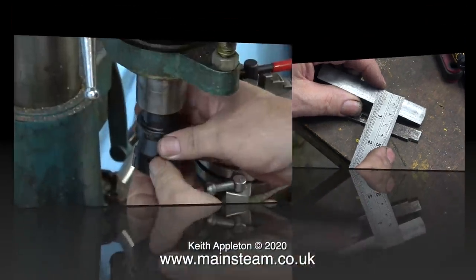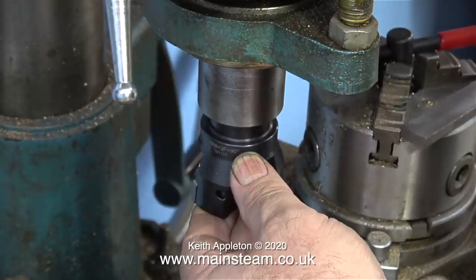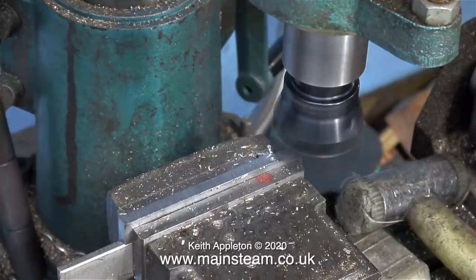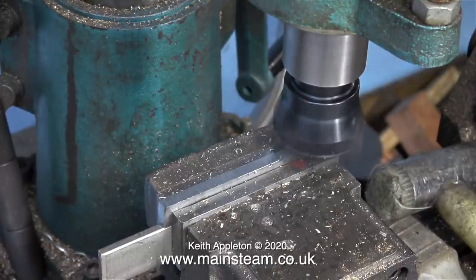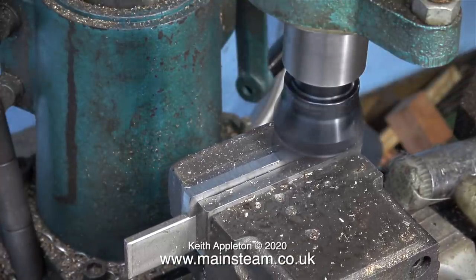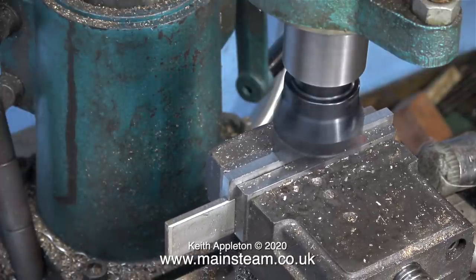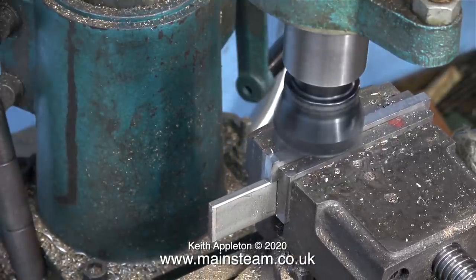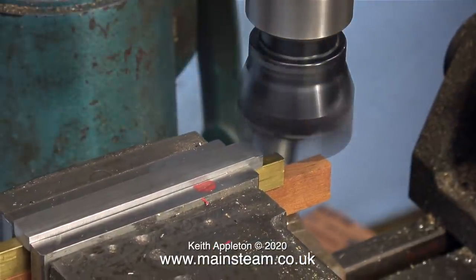But I have the technology, thanks to a man called Dan, who sent me this really good face cutter. Here I'm fitting the cutter into the R8 taper of the milling machine. With the bar resting on a suitable piece of packing, it's a very simple job to reduce the width. The milling machine I have is not very good quality — it's very old, made in Korea, and it's called a Nairok, which is 'Korean' spelt backwards. In conjunction with this Chinese-manufactured cutting tool, it makes short work of the bar on both surfaces.